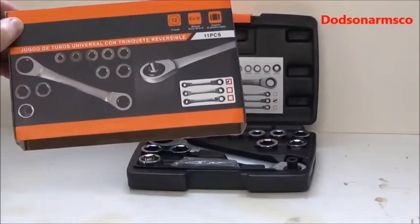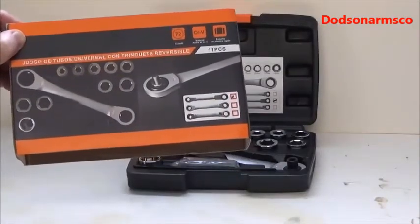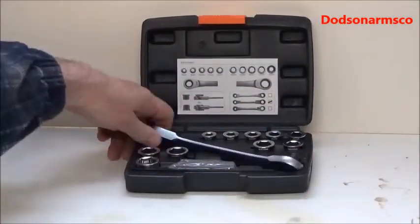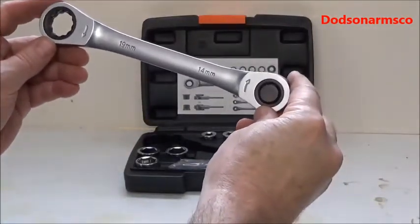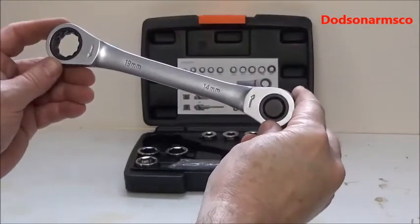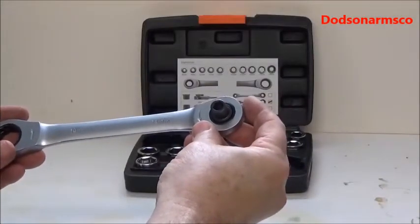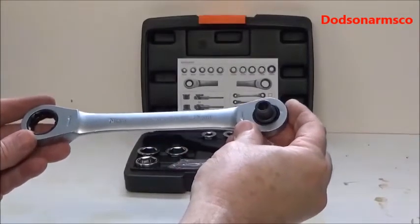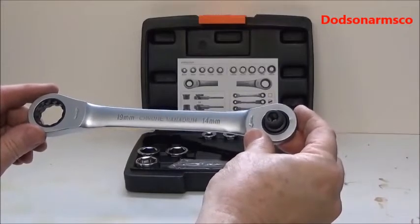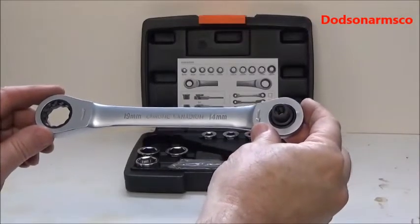You could get different kinds of wrenches with it, but the only ones I've ever seen in the U.S. had the standard wrench. What makes these interesting is it uses a standard 19-millimeter and 14-millimeter wrench to power the sockets. On the 14-millimeter side, that would be the equivalent to your quarter-inch sockets, and the 3-eighths would be on the 19-millimeter size. So if you lose this or you break it, you can always use a 19-millimeter or 14-millimeter wrench to utilize your sockets.